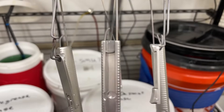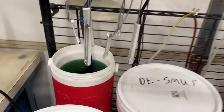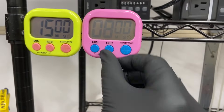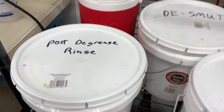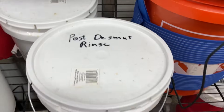We're going to anodize these fixtures — they are vapor blasted with glass beads — and they're going to go into the Simple Green solution, which is just the standard concentration of Simple Green Industrial. They're going to go in there for five minutes and they're heated to 140 degrees. I've got three different buckets here: post-degrease, de-smut, and post-de-smut rinse.